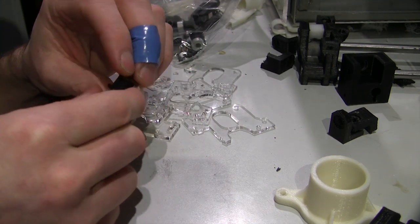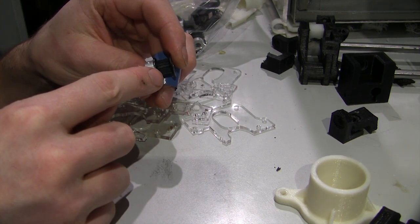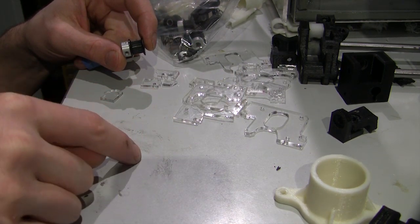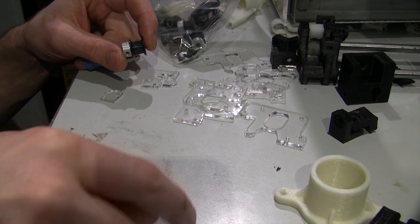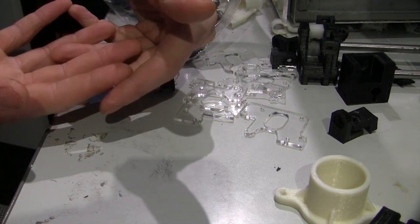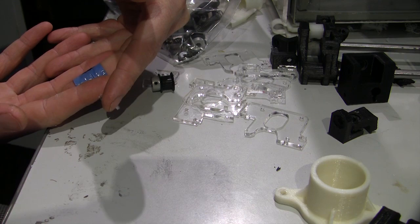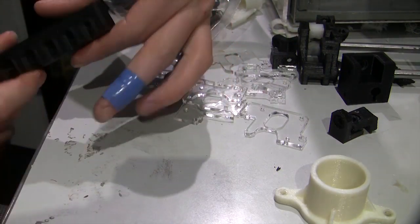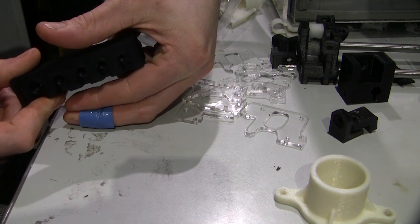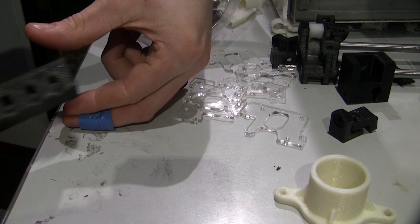But basically all the belts and pulleys, the teeth in this pulley and in these timing belts, they're square, right? So each tooth on the belt, line down, line up, we're talking square teeth. So of course that's going to cause backlash, because there's nothing pushing the teeth together to stop side to side movement. As in, you've got a square tooth and any movement like that is not going to be cancelled out. Even if it's bottoming out on the slot, you'll still get movement like that. So there's going to be backlash in it.